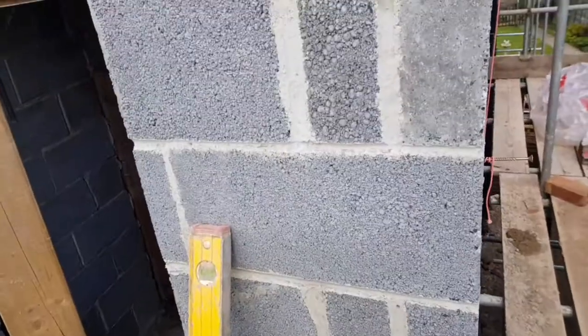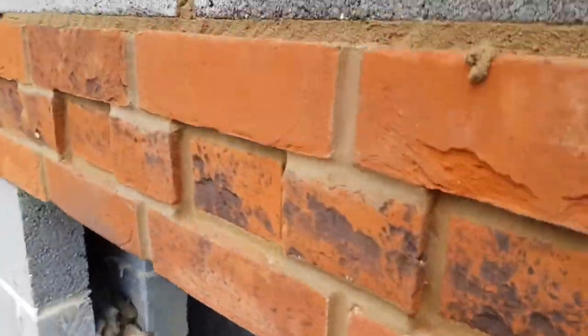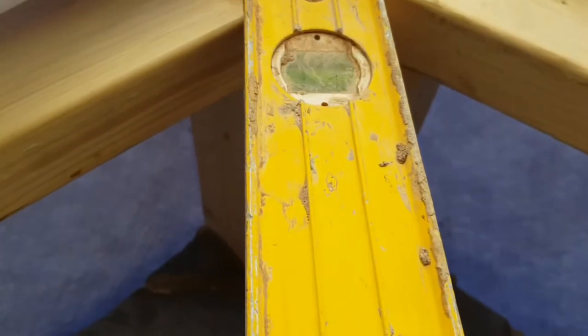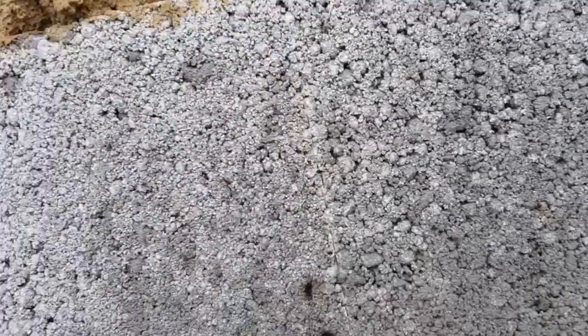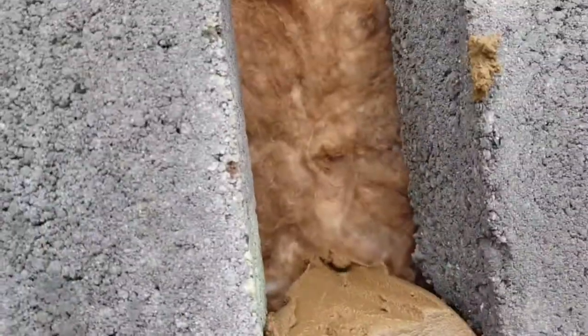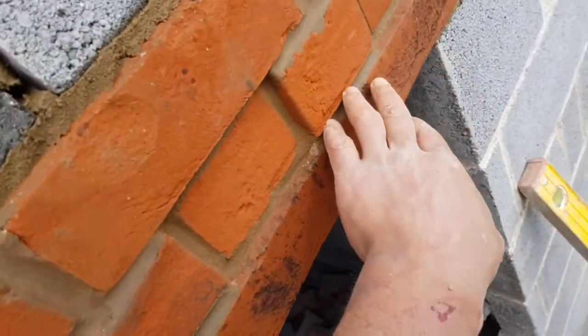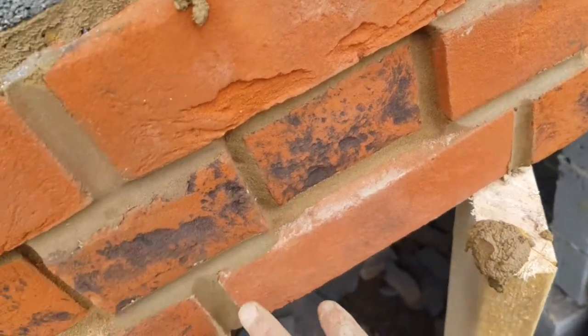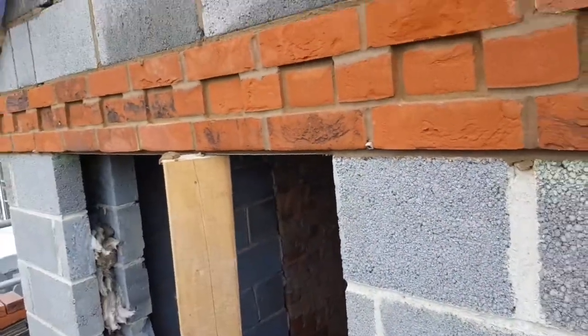Let's crack on. This is where we're at with the front gable. He wants a little cross in the centre - I've gone right to the top of my ridge, I've plumbed down, marked it on the wall, and that is where my first soldier is going. I've also plumbed down even further and measured off my opening - I've got 595, 595 either side. So not only is it centre off my roof, it's centre off the window opening. Hopefully it all works out, we'll see.